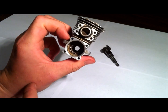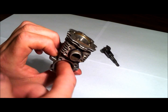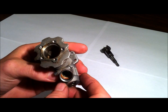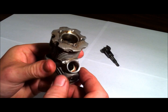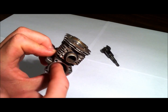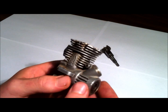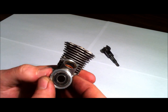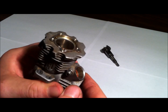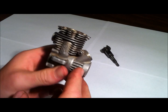And that's it — it's pretty much all torn apart. You got the bearings in there. I found out my bearings are awful — they're very rough. I didn't maintain this motor at all when I ran it, and I had it for a long time. It just goes to show: if you don't maintain it, the bearings will go out. But that's it. I should do another video on how to remove the bearings and replace them. I found a couple of places online where you can get them for like seven bucks. Once I get the bearings ordered, I'll make another video on how to replace them. Thank you.